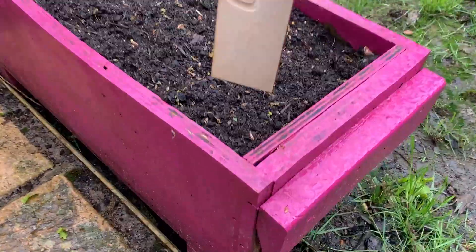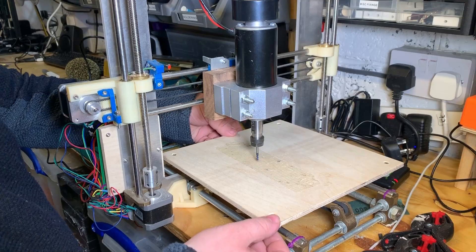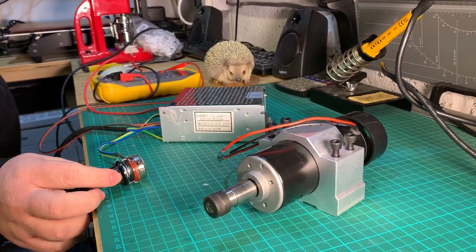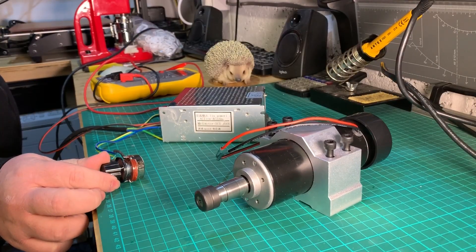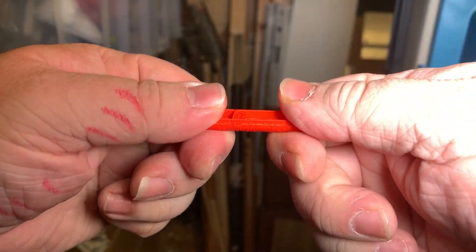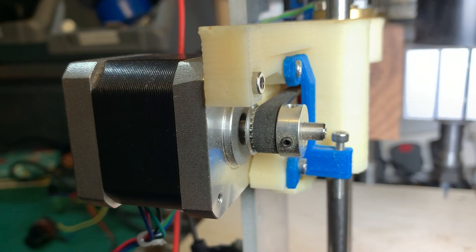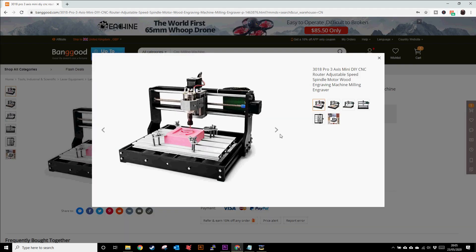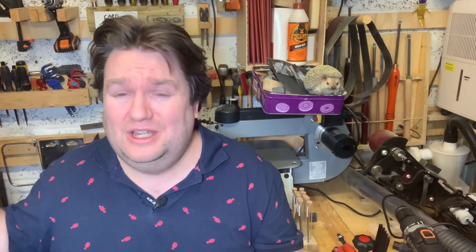So I learned loads making this thing. For light cuts and engraving it's actually a really useful machine, but you can see from the wobble it's not suitable as a serious CNC. The spindle does not need to be changed — it's pretty good for a small machine, and you could use more powerful ones as well if you need it. I bet I could make this thing better — add more powerful motors, change out some of the plastic parts for something more rigid, change the belts for lead screws, maybe redesign the structure overall. But no, I'm not even that crazy, when you can just go and buy a fairly well-designed little machine for about £150 or $200.